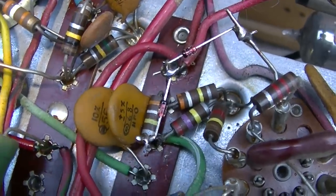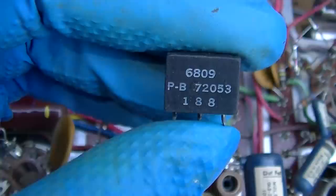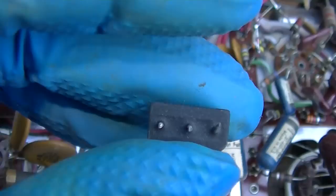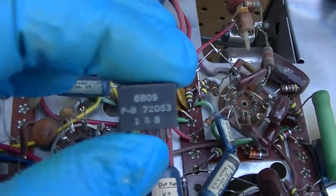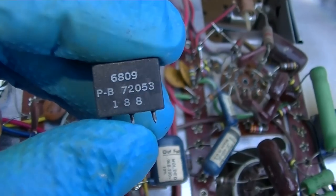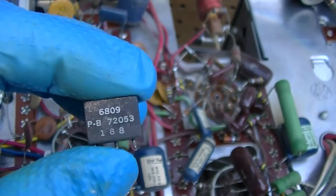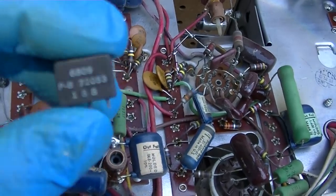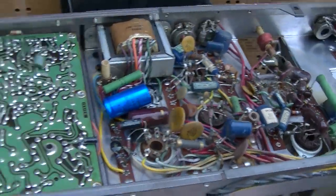All right, there are our two diodes. They're kind of hard to see, but here's the original — a Packard Bell part number from 1968. It lasted... at least I think this is what's wrong. And these are hard to test. You can't really test these unless you have a higher voltage meter, and even then they get leaky. But I would almost say, if you're restoring a set, just replace this — replace the selenium phase detector diode. Just replace this. It's not worth it. But hey, we got 2,500 hours out of it. And this is a learning experience, so that's what we got.